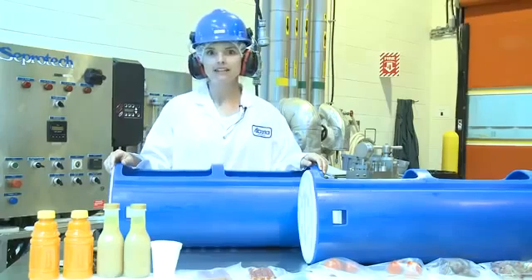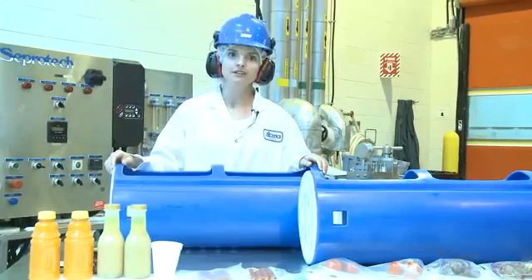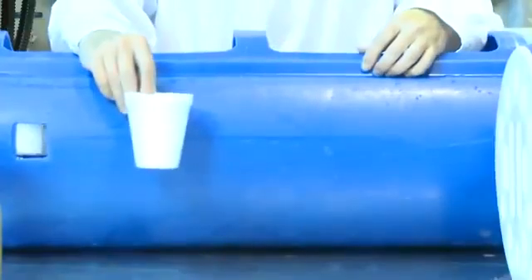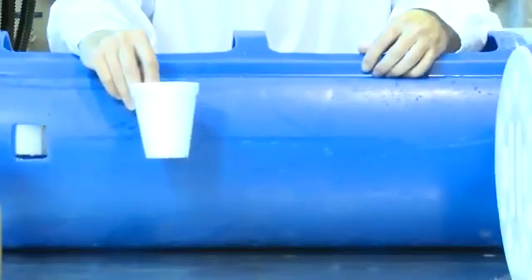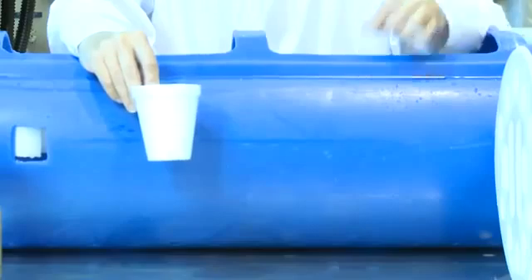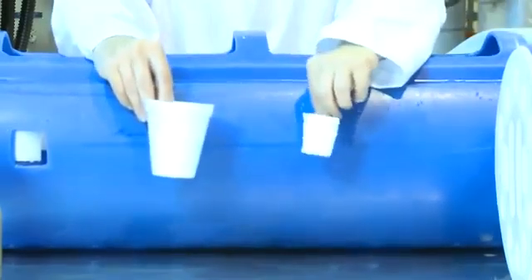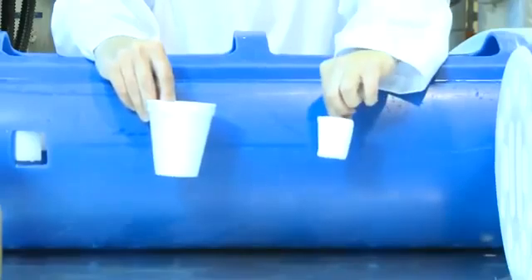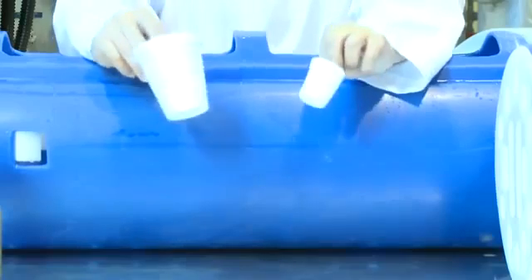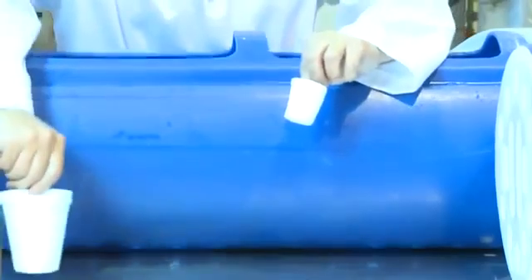To highlight products that may be inappropriate for high pressure processing, I put a sample in a Styrofoam cup. Styrofoam has a lot of fixed air bubbles. With high pressure processing, these air bubbles will be crushed and compressed. Here's our Styrofoam cup that has had all the air removed. Similarly, products like bread with formed air bubbles in it would not be acceptable for high pressure processing.